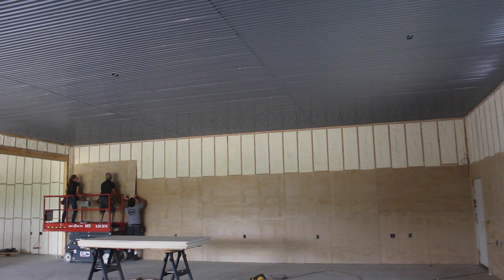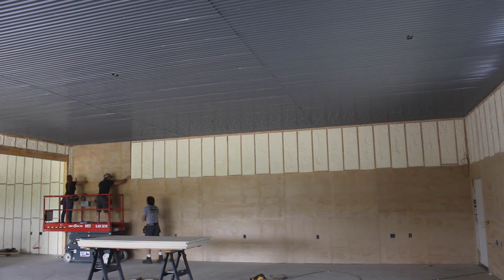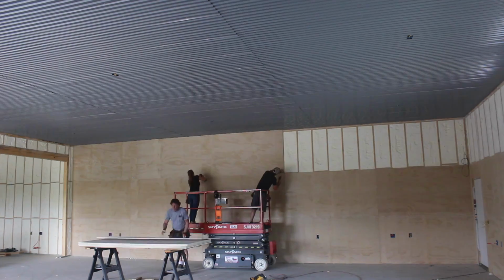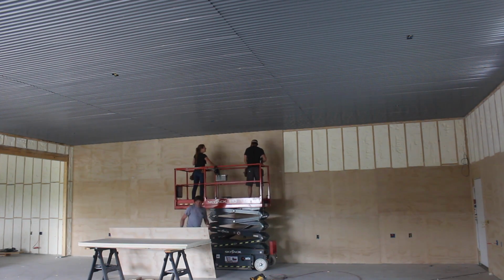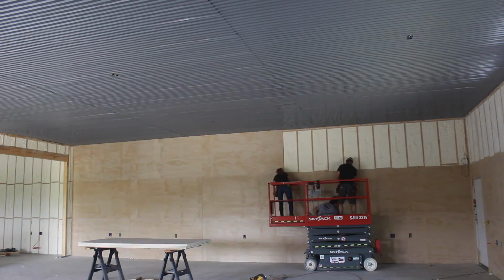Okay, with the ceiling in, it was back to the walls. My walls are 12 feet, so 3 rows of 4x8 plywood fit perfectly. In fact, before laying down the first row at the bottom, I measured the entire span to get a fix on the distance so that I could make sure the spacer I was using wouldn't mean that I had to rip down every single sheet up at the top. As I said, I used a carpenter's pencil down at the bottom.